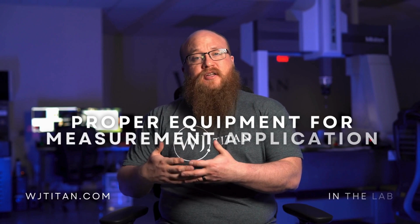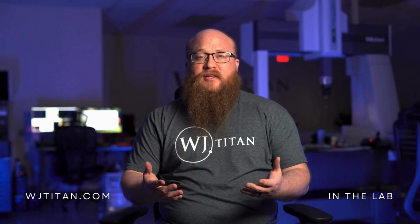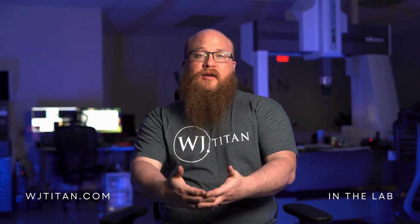So today we're going to discuss proper equipment for measurement application. And what that means is, I'm sure multiple people have run into situations where you measure something on the CMM, you hand it back, the operator grabs a pair of calipers, measures the same distance and says, well, it's good here, how can it be bad on the CMM? There must be something wrong with the CMM. Or vice versa, you check something on the CMM, it fails, they grab a pair of micrometers, they measure with micrometers, and it passes. And we're gonna discuss how that works and what that really means.